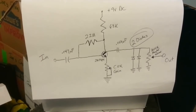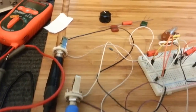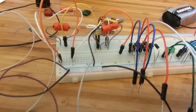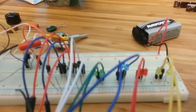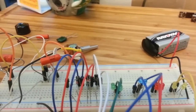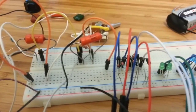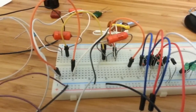In this case I've got a guitar plugged in here. You can see the end that goes to the guitar is wired up to the top half of the breadboard, and then the bottom half has all kinds of diodes. There are silicon and germanium diodes as well as LEDs. Each one is set up with positive end up and then with negative end up, and these jumper wires are going to be brought over to bus number 23, and we're going to use the power of chaos to shape a musical note.